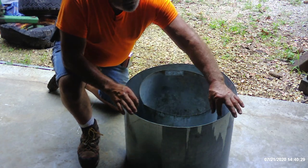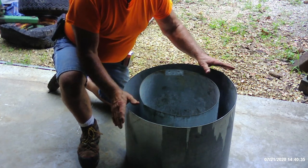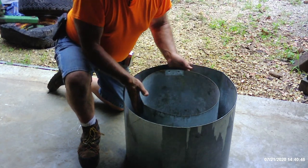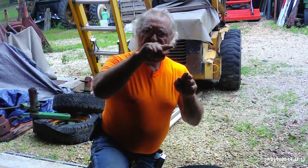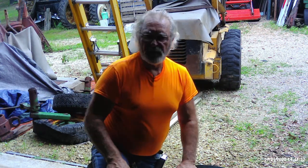Here we have it — a quick and simple 17-inch tall form for a 3-inch extension ring for his septic system. He's going to cut 3-inch plugs of wood and set 4 of them around the perimeter to hold this stable at 3 inches. Then he'll pour his concrete from the bottom up, pull the plugs out once he gets to the top, and let it cure. He's got the reinforcement rod to drop down inside to make sure that if it does crack it doesn't fall apart. As long as you have access to one of these little seamer tools — I've got them with eighth, quarter, three eighths, half inch and three quarter inch grooves — you can fold the joints by hand, set them with the seamer, and lock with your punch.